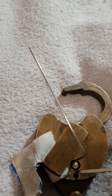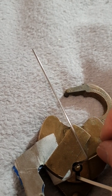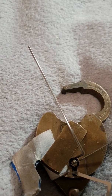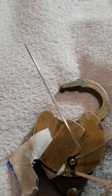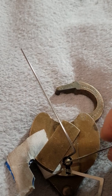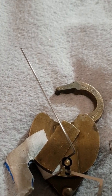And then I in turn go and put this thing in place, and I'm able to manipulate each particular lever tumbler, similar to how the British pick their lever tumbler locks, kind of like at the 12 o'clock position, but I just did it manually. And this is the best method. So I put torque on this Z-bar and elevated each lever tumbler using this Z-bar and left this thing in position, and yeah, I got it open.